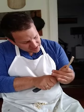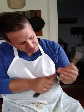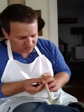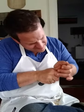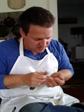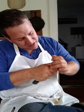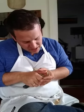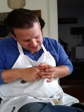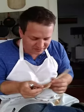So one of the things that's interesting is this wood is relatively fresh compared to the... well, no, I guess it's the same piece of wood. It's just the sapwood behaves differently than the heartwood, and so as I'm going from the sapwood to the heartwood, you can hear how sort of squeaky it is, and that's a function of the difference in moisture content between the woods. And to some extent, this heartwood that's right up against the sapwood behaves differently than heartwood that's in the center of the log as well.